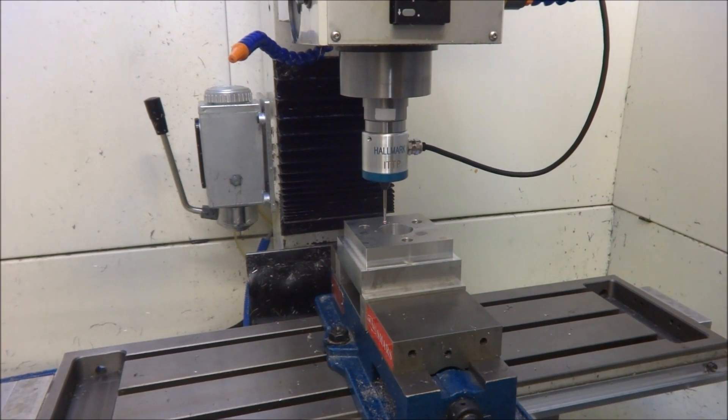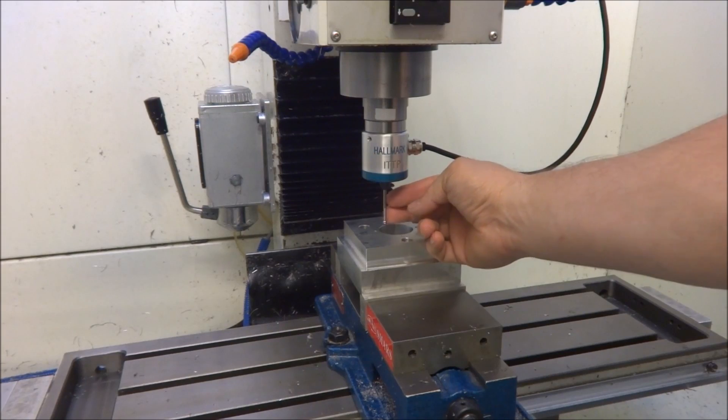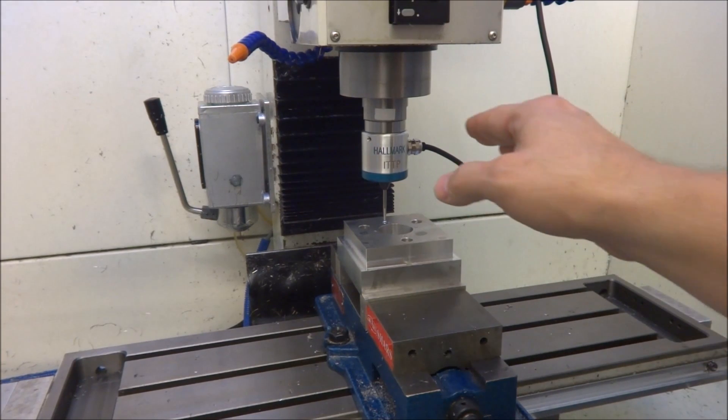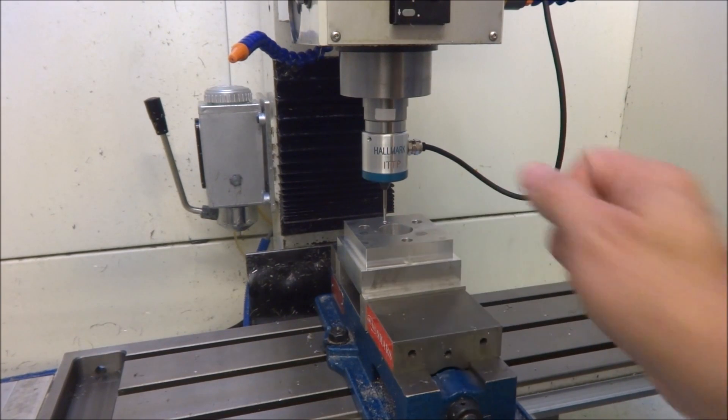The way some probes are made, they're not always very accurate. If you notice on this particular touch probe, the stylus is not ceramic — it is all metal, and the tip is not self-sacrificing. That was a big plus for me. On top of that, they've developed a special fluid that keeps the contacts from oxidizing, so you don't get false readings on a regular basis. Some other probes on the market, if you don't use them for a while, you might get buildup on the contacts. This special fluid is designed to prevent that. If you're jogging into your work and doing some probing, you're not going to break the stylus off.